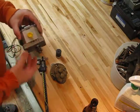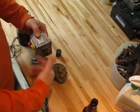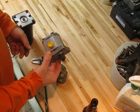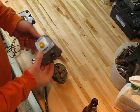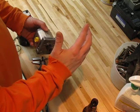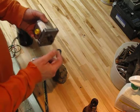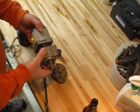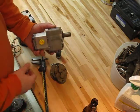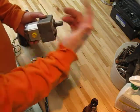this, which is a hydraulic pump, or actually a hydraulic motor, sorry. You drive your oil pressure through here, drives this and does whatever operation. In an application this came out of, there was an electric motor driven saw, and through a set of pulleys it also drove this via this little adapter here. So there was a sheave on here, a flat belt sheave, and it drove this, and this produced hydraulic pressure to perform some other operations within a machine that spun.